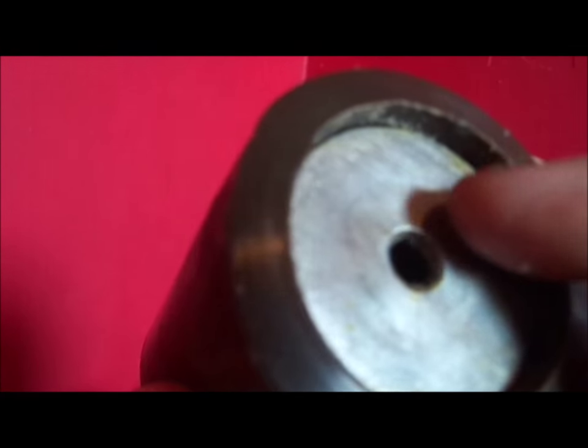So you want a little space on the end. The reason for that is, during different weather conditions, that band can change. And it is usually necessary to get the best recordings. If you're going to make a recording that's going to withstand being played and also can be recorded on, it must be a medium hardness. It must be hard enough to withstand being played, yet soft enough to be cut.